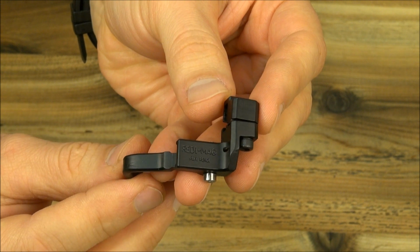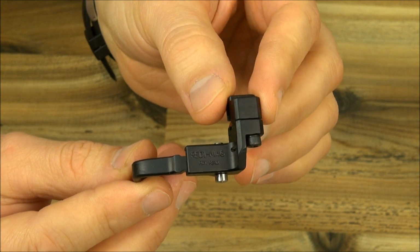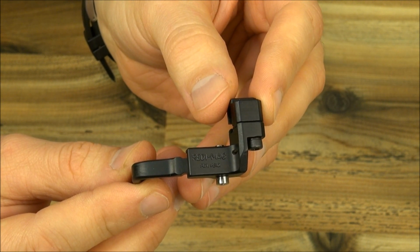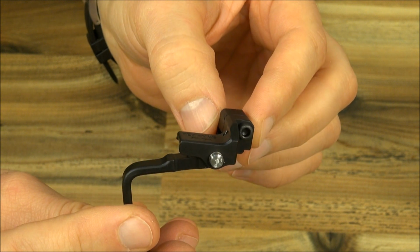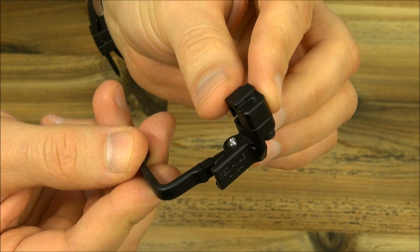To start, here's the bolt closing lever pre-installation. The parts moved by the magazine follower to lock open the bolt are lighter in weight than a lever of conventional design, yet we still use a strong and long 6-32 Allen head cap screw, giving it a more secure attachment.